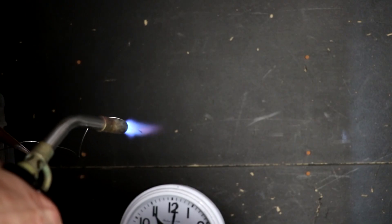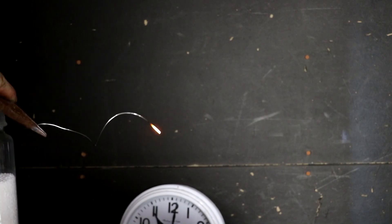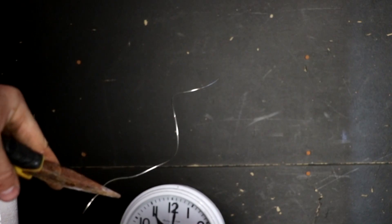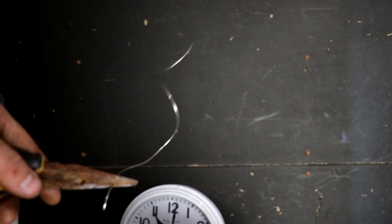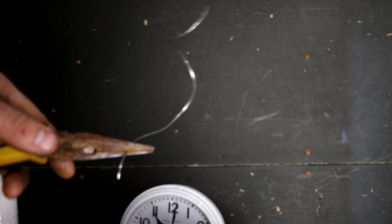Here's a piece of that stainless steel wire. Let me heat this up with a blowtorch. As you can see it does not burn in air, but in pure oxygen it burned just fine. It's amazing what changing the oxygen concentration from 20% up to 100% can do. The reason it does this is you're not having to heat up all that inert nitrogen, so the flame becomes much more efficient. And even though it's got chrome and nickel and stuff added to the steel which makes it pretty inert, it can still burn in an oxygen atmosphere.